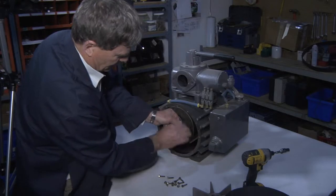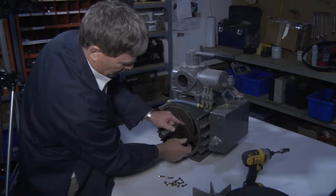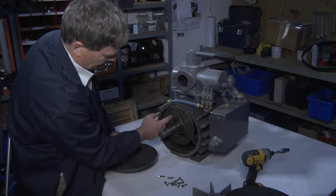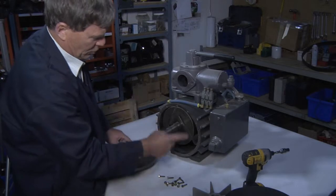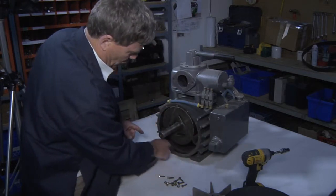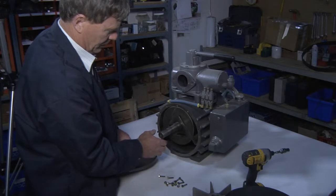As the pump rotates, rotation is this way. As the pump rotates, centrifugal force forces the vane out. It touches the body, rotates, and by the time it gets back to top dead center, it slides back into the vane carrier port. So it's a continuous movement of the 3 vanes going into the port and coming out of the port and following the wall. That rotation creates all the airflow to activate the pump.